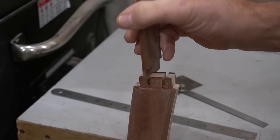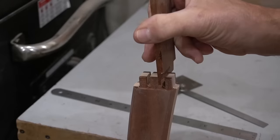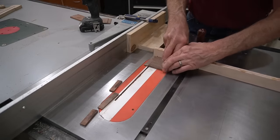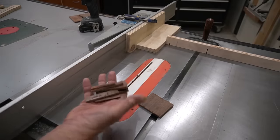The blank starts into the slot, but quickly tightens, so I know the taper will tighten the fit of the tenon when the wedge is driven in during glue up. Once I've got bevels cut on the ends of enough pieces for all the wee wedges, I switch the table saw setup and trim the tapered pieces off the ends of the wedge blanks.